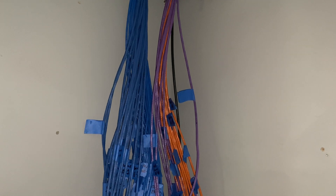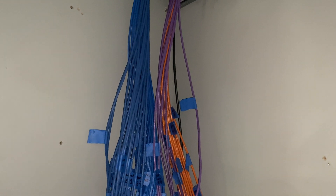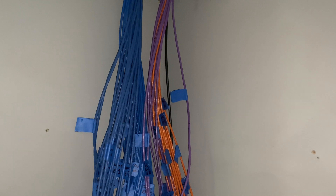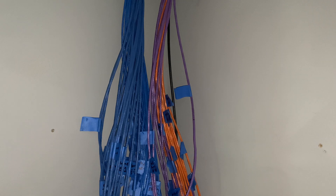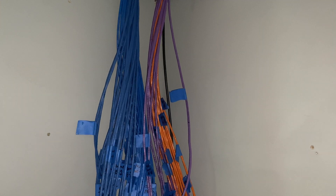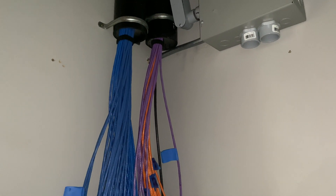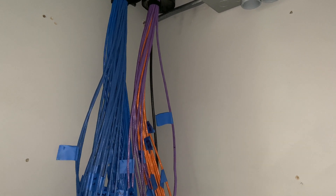The tool also lets you configure security cameras. I basically dropped cameras all around the property and could see their fields of view — the angle and cone of visibility — to see where everything overlapped. I was able to find the magic number of cameras needed for full perimeter coverage, which was 11, including the Ring doorbell. That's what you see with all the purple cables, and those will be running POE as well. I just color coded it for security.